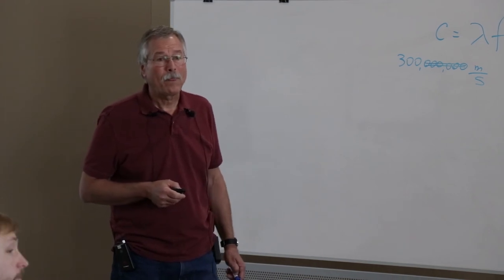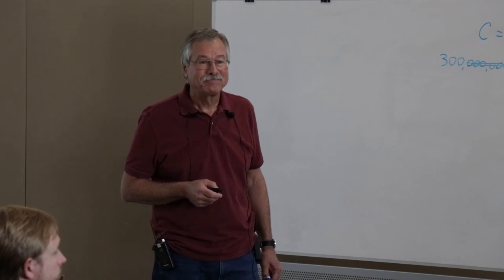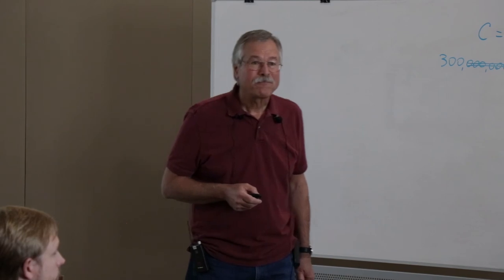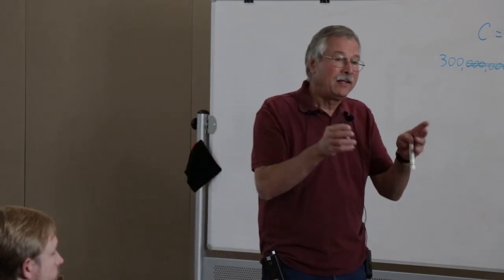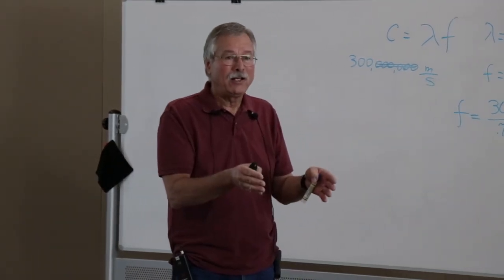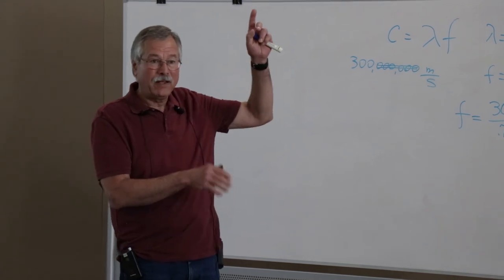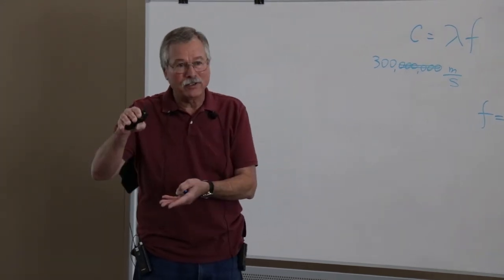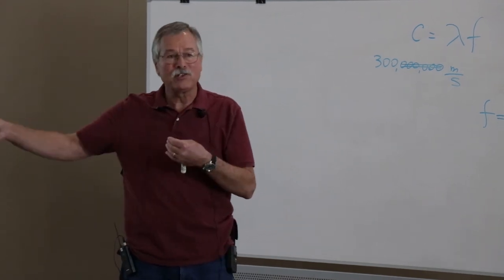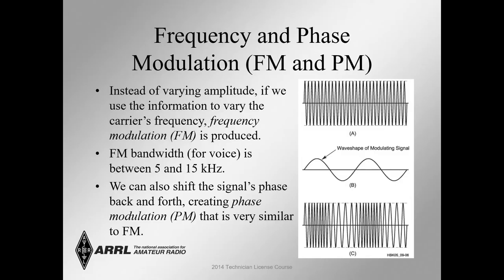Now, I'm old school military. The FMs that we have in our trucks were line of sight. But our AM radios, we were able to talk all the way back, and not because it's AM or FM, but because of the band that it's on. Your AM radios were on much lower frequencies where you could put up big antennas and talk long distances. Your FM radios had short antennas and they were probably at 100 or a couple hundred megahertz, much shorter range at those frequencies because of the way that radio waves propagate. And we'll talk about that.